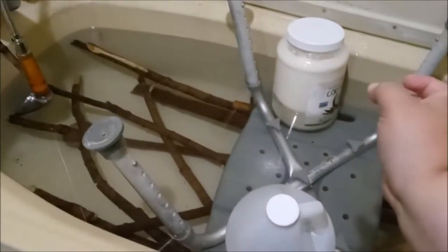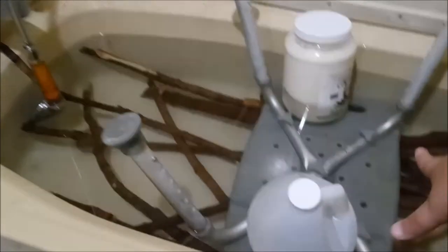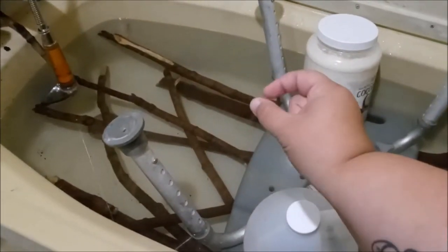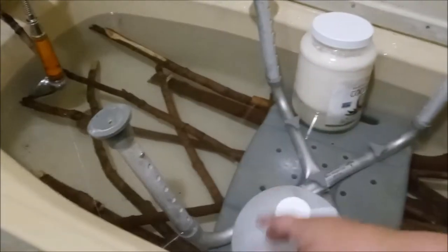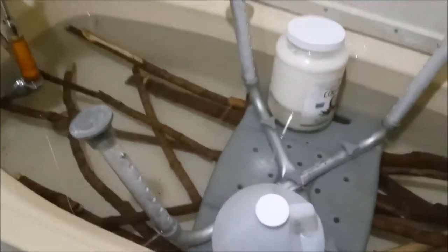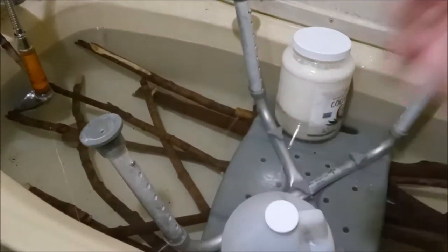We just put our final pot of boiling water over it to get to the temperature I want, and we put some weight on top so they stay submerged. We're going to leave it like this for about 24 hours minimum, because we want all that water to really soak to the core of the wood. You don't want any remaining pests to be inside your wood — which is the whole reason we're doing this. I'll leave it for 24 hours, maybe more.